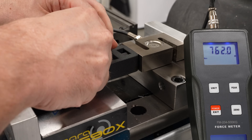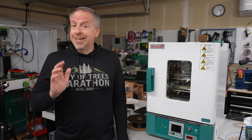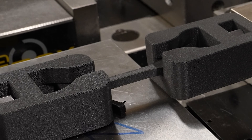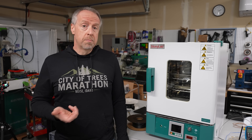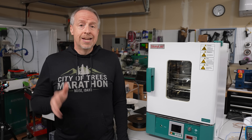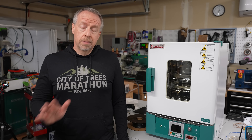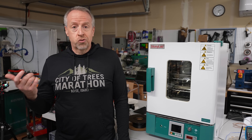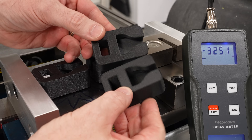When I got to the horizontal samples, it became clear pretty quickly that my test rig was not prepared for the forces involved. It did hold together, but it took a firm hand on the vise handle, and I could see the 3D printed grips flexing under the load. The grips are printed in PAHT carbon fiber, which is quite a bit weaker and more flexible than the PPACF I'm testing. The obvious fix is to print the grips out of PPACF, and I already printed a set just in case, so I swapped those in.